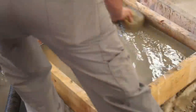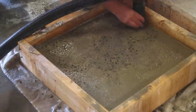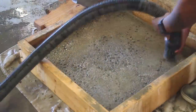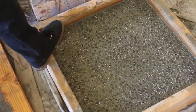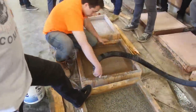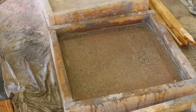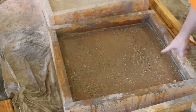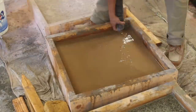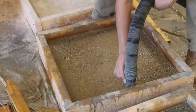It actually maintained the color hardener with the exposed aggregate, which was surprising to me. Here are the glass beads — we're starting to expose them. The nice thing about these high boxes we built is they held the water so it didn't run all over the inside of the facility. This is exposed with color hardener, and even though it's still not rinsed thoroughly, you can see the color hardener is staying there even though we've exposed the rock — the color hardener went deeper than the rock.